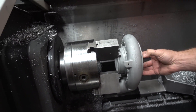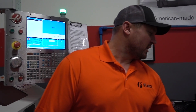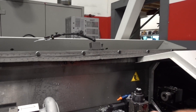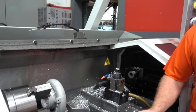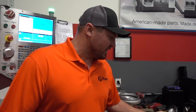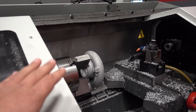The first cheetahs were made on a South Bend lathe from like the 1930s — a leather belt lathe, not CNC. You don't have the ability to make curves and radiuses, so you've got to cut steps in it, use a file, spray it with bluing, and it was about an hour-long process after I'd gotten the hang of it. I made like 20 of them that way. When we got our first CNC lathe, it was a big purchase — we actually framed the purchase. That was back in like 2008, still out at the Pole Barn, the original 3,000 square foot shop.